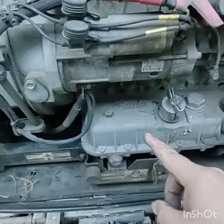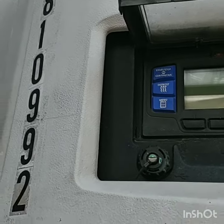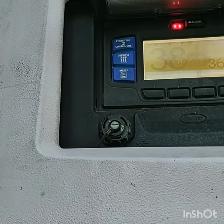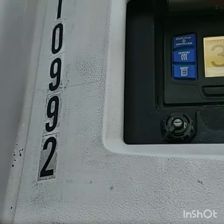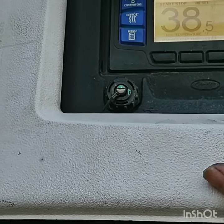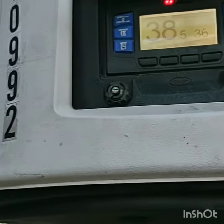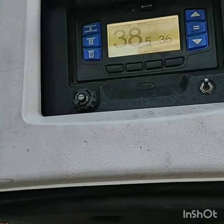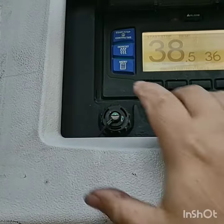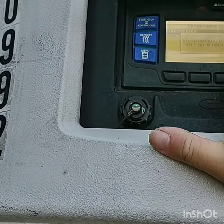Now let's go down and I'm going to show you how to run the computer pre-trip on this thing. We're going to run a pre-trip with the electronics itself — let it fire up. You get to this menu a different way with the Carrier versus the Thermo King. I got an alarm here — I know what it is. It says no active alarms, so I'll just exit. What it is with the Carrier — a lot of times when you sit in a dock with your doors open at minus 10, the temperature gets out of range and it'll say box temp out of range, and then that code is stuck in there until the mechanic clears it, even though you got it back in range.